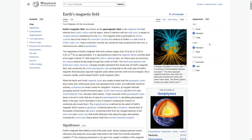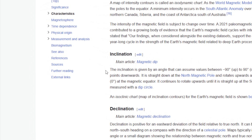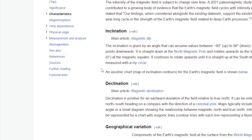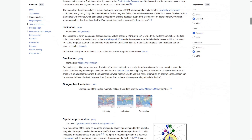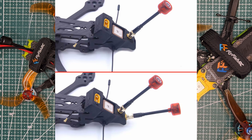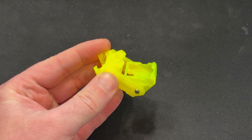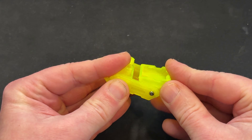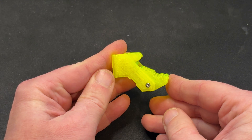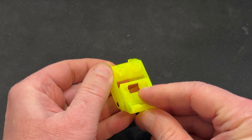This tutorial doesn't go into more advanced topics like magnetic declination or magnetic inclination. These values change depending on your exact location and even slowly over the years, but for most of us Betaflight works just fine without manually adjusting those. I also recommend mounting your compass horizontally to the frame. If you are using a TPU mount that has a noticeable tilt, you absolutely need to know that angle and enter it in Betaflight under the pitch degrees settings in the compass tab. In general, a flat fixed mounting position works best. If the TPU mount flexes, bends, or rotates even slightly — especially after a crash or just carrying your quad — your compass readings will be wrong, so avoid flexible mounts.